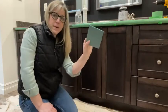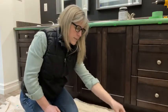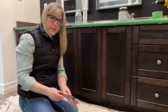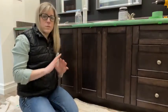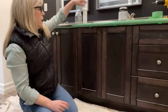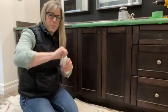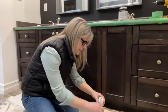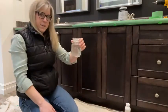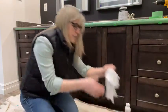I'm going to grab the sandpaper that comes in the roller kit. I also have a 400-grit sandpaper as well, and that is for in between coats. I have all of my supplies here. There are some extra brushes, but I'll talk about those in Step Two. So Step One, I'm strictly going to show you the prep work and how to start painting your cabinets — starting with TSP. TSP is a concentrate. I have a mason jar here with water, and I'm just going to add a couple of capfuls to it. It's that easy. It's going to last you for lots of projects. I'm just going to give it a little shake. This is all organic, so I'm not worried about wearing gloves. You don't have to rinse it off. It's super easy — you just have to wait for it to dry.